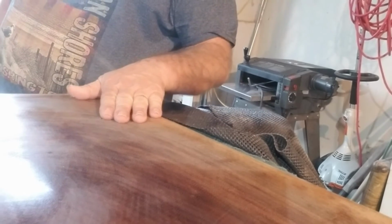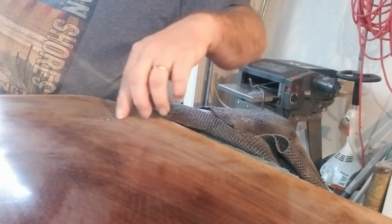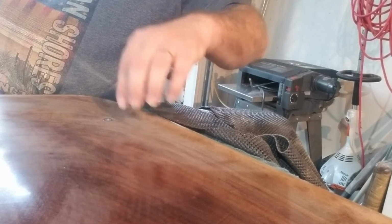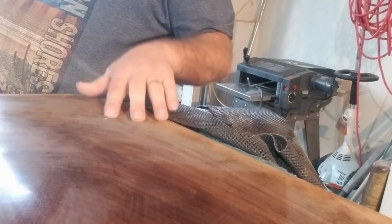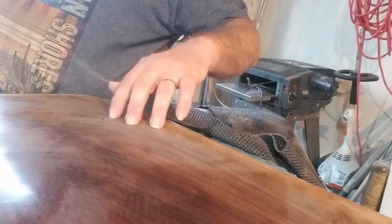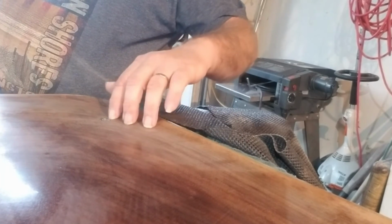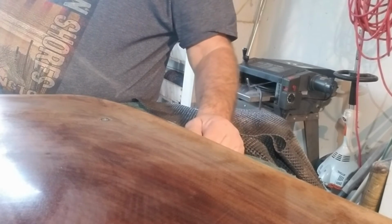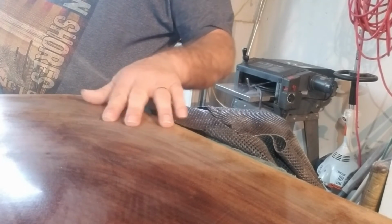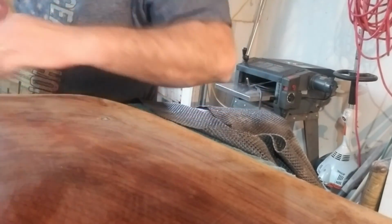But anyway, so we've got those. Those are all nice and flush, countersunk. So that's, again, I had that little pop up of that plastic, and I just hit it with a countersink tip, just kind of keep them flat. I have had a couple that I've left proud. I really thought about leaving these proud, but after I saw that epoxy kind of give me that ring, I thought, I don't really want that there. So I went ahead and did the countersink. I did put a little bit of glue up around the countersink, but it went pretty well.